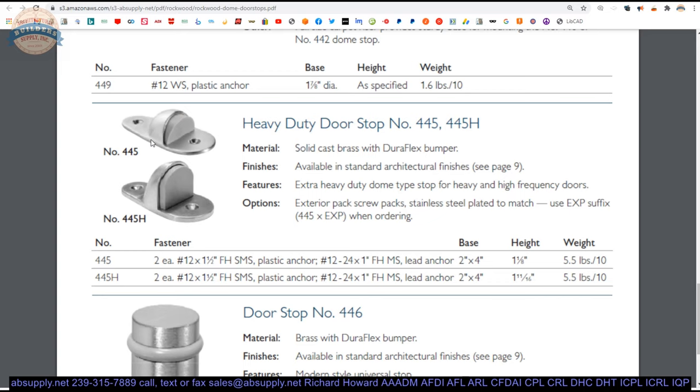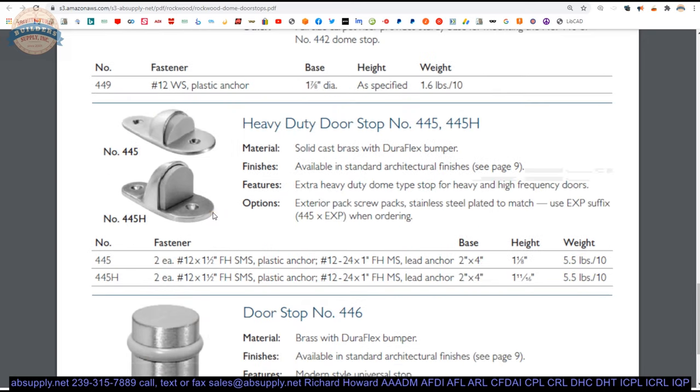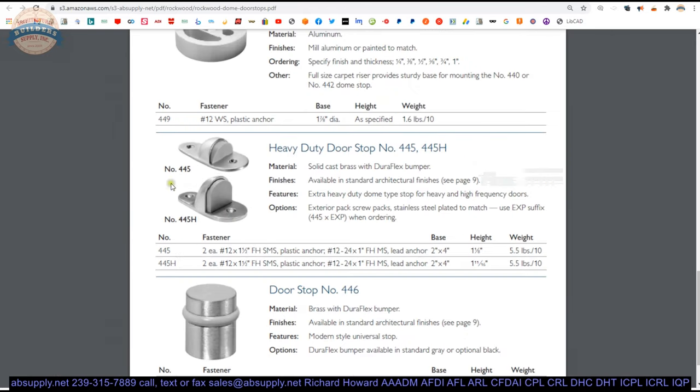In a major airport members-only club where doors get lots of use, you'll want to specify a heavy-duty application immediately. A 446 looks nice in polished brass, but it's no good if the door is pushed so hard over time that it bends out, the fasteners rip out, and then a $500 lock or thousand-dollar pull handle makes unintentional contact with a thousand-dollar drywall repair. That's the point.